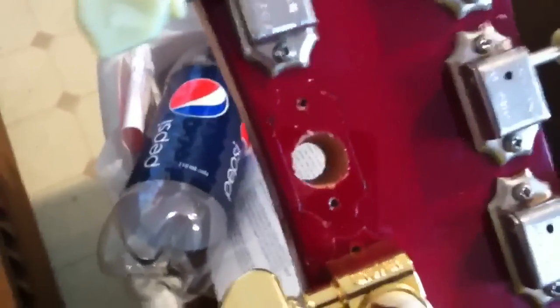Alright, so I've now reamed it out, and I've also tried to hug the upper end right here as you're reaming, because the hole down below matches up perfectly as it is. You kind of want to remove more of the top than the bottom. Just something that a few people have noted online, so I really tried to do that. So we just test it to see if it fits in there. It fits in there nicely.